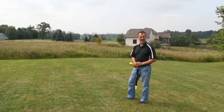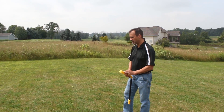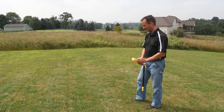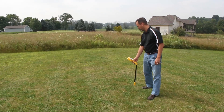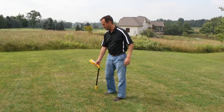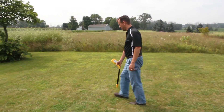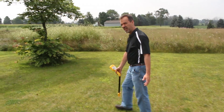We're out here in the yard. I'm transmitting a signal that's being induced onto the cable, and when I turn my wand up, I have it in the null mode so I'm looking for a null. There's my null — I can track it either towards the house or I can track it back towards the cable box. Pretty standard locating.